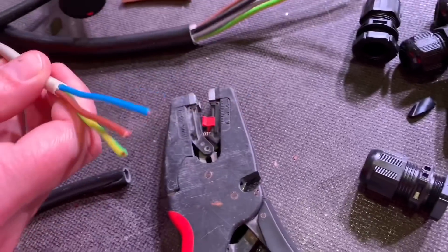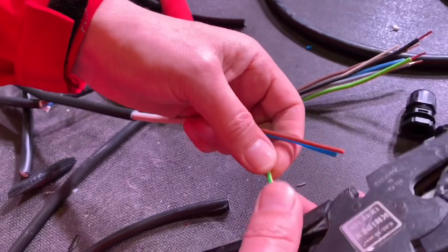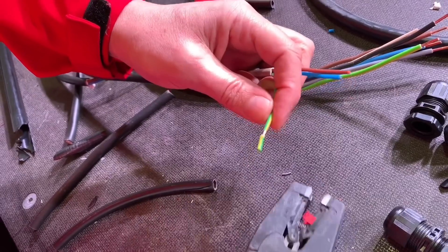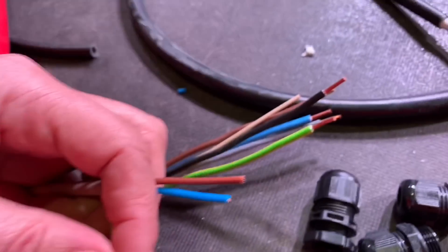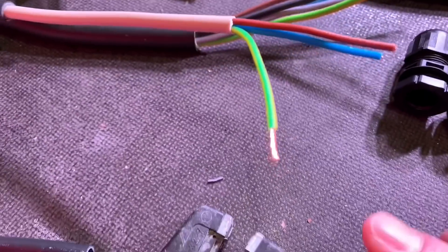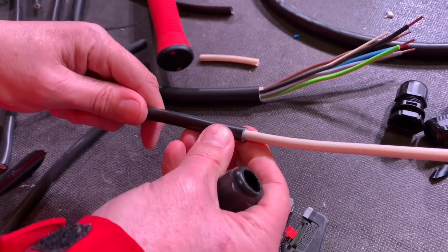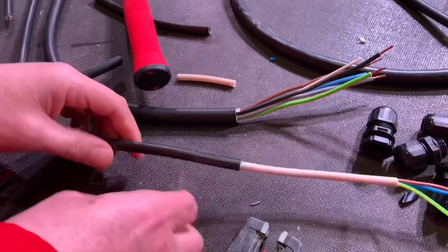Tough sheath from Doncaster uses the same principle as armored cable — all stranded conductors. They go up in core sizes from three-core 1.5mm² up to five-core 6mm², and also three-core up to 10mm². You'll see stranded conductors inside compared to the solid ones in NYY. Another advantage: because there's no armor to terminate, you don't have the challenges of fitting steel wire armored glands, giving great flexibility.